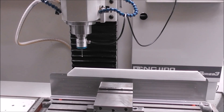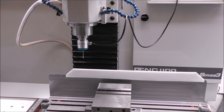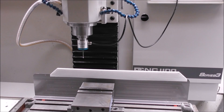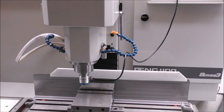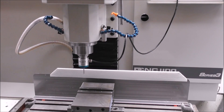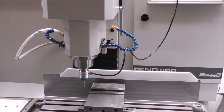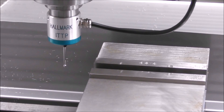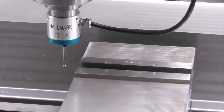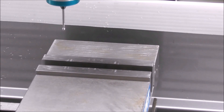The hallmark impact tolerant touch probe is impact tolerant and it's much more relaxing to use. You can jog up to your part and quickly come in without being too concerned about crashing it. Within the range of its retraction zone you can crash in vertically and sideways without breaking the stylus. It's not a fragile self-sacrificing stylus. Because the stylus is rigid and strong it flexes much less and is inherently a lot more accurate.